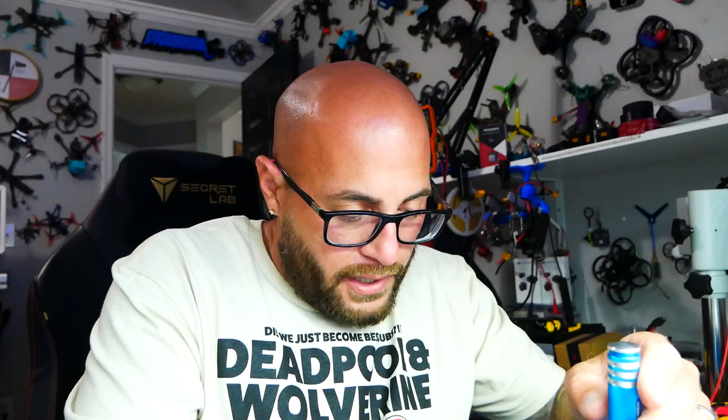The last thing is putting on my top plate and making sure everything comes together. After this, we have to jump into the DJI Assistant for the consumer drone series, activate it, and then flash the latest firmware — easy stuff. Then I'm going to bind it to my goggles, which will automatically bind to my radio. Then I'll jump into Betaflight, set up my switches, make sure my OSD is good — very important — and check my MSP and serial RX, because I need to go to serial RX receiver and set it to SBUS since that's what we rolled. You'll find that in the receivers tab. I have a video linked in the description to help with that if you need it.